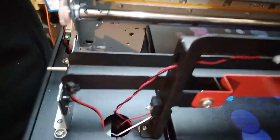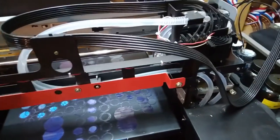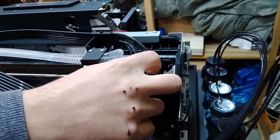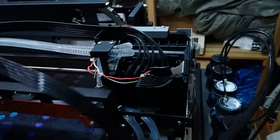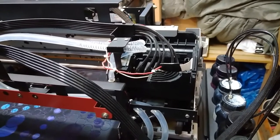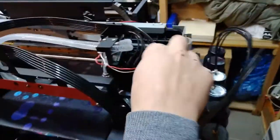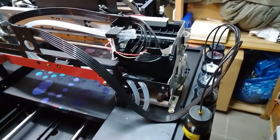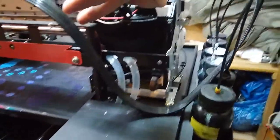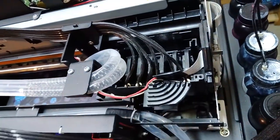We got that off, and now the easiest way to test if something is wrong with the cable is simply to disconnect this power supply over here, connect the other cable from the outside, and connect it directly to the motherboard. So that's a plain, simple way to come to a quick conclusion about what could be wrong over there. So let's just release this zip tie. Gotta be careful not to cut the power supply. That's okay.